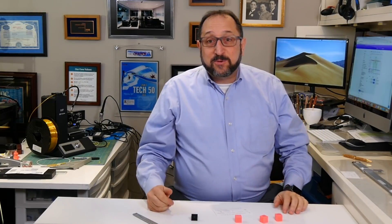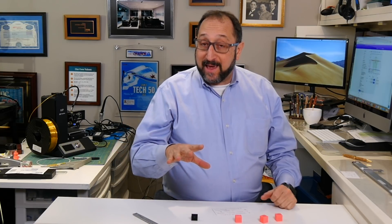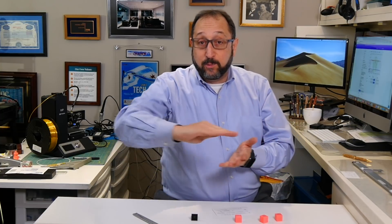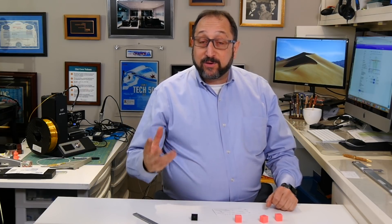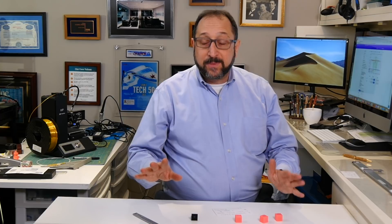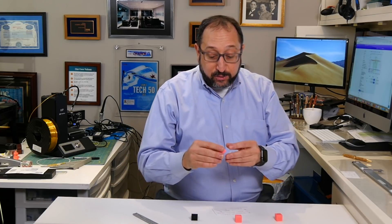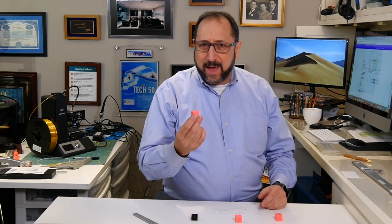It's been a very interesting two days. Let me recap what I've learned. Number one, ghosting is a difficult problem to correct. I see it on all my printers; I saw it more on the MP10, and I believe it's because of the large print bed which caused more vibration as it went back and forth. Putting just vibration dampers under the MP10 did not solve the problem. Adding the rods got slightly better, but really not dramatically better — I was surprised.